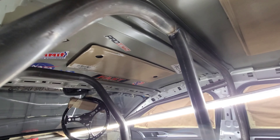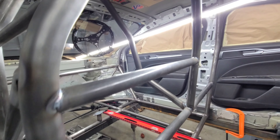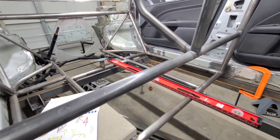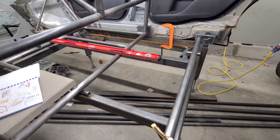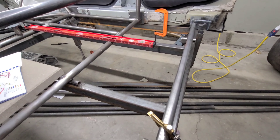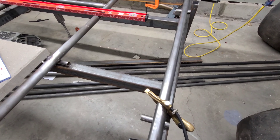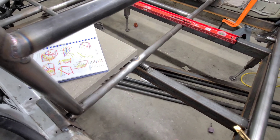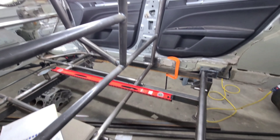There's the back side of the main hoop and how we did it — really nice. Actually, that was the first main hoop that we bent which was a little too long, so all we did was cut it and it was perfect, and had to notch it, but all that is tied in and done. Also got the rear number one bar. This is technically the number one bar on the chassis where the four-link brackets go, but since it's a four-door it's not going off of this number one — it's going off of this number one, and all this will be tied in just like it normally would on a two-door car.